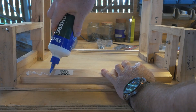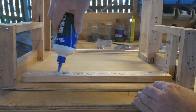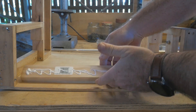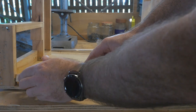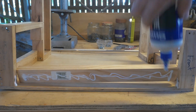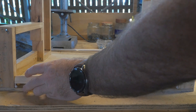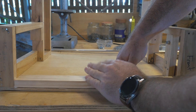First I'm going to put some glue on the base of it, then we need to make sure we put glue on the sides as well — anywhere it comes into contact we want glue on there. You can put a screw up from underneath to lock it in, however I'm going to use the C-clamps or bulldog clips to hold it down. I've put the glue on it, and now it's just about putting it in position, making sure it's nice and flush against the plywood base right on the corner.